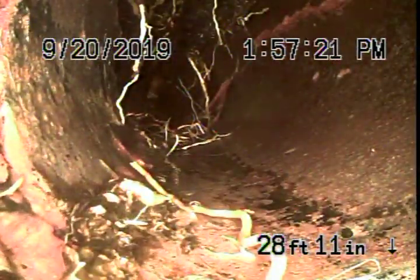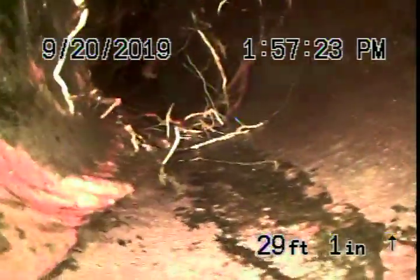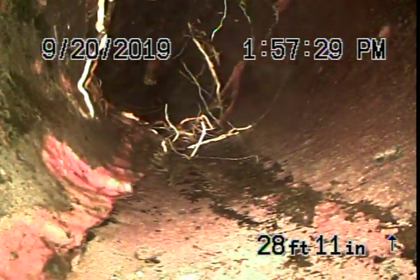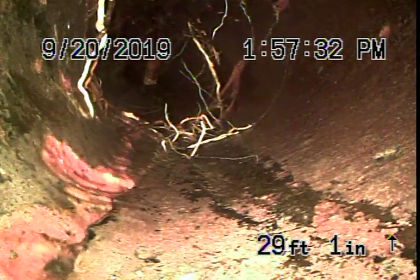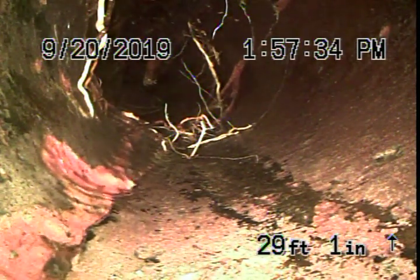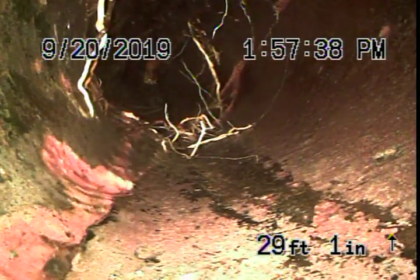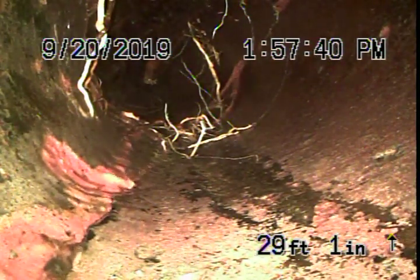You can see a big stub of roots coming up from the top right there. That's because the top of the line is gone — you can see where it's clearly cracked and open. Definitely in need of repair. I cannot continue jetting on this, as it would break even more. It's now open way more than it was before. I recommend emergency repair for the line.